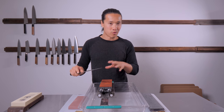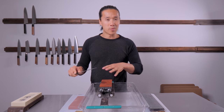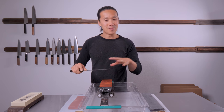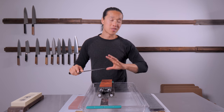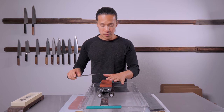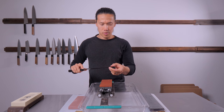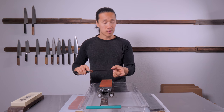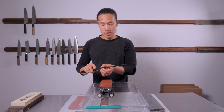For some people who are keen, you may have noticed me twist or turn the stone. I do that out of habit because it helps the stone wear more evenly. I'm a former short track speed skater — that's how I sharpen my skates, turning the stone with every pass. That was pass number three, and we've got a really nice fine micro-burr on this knife from tip to heel.